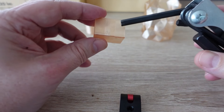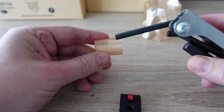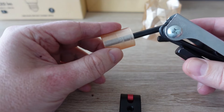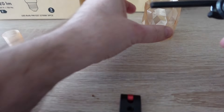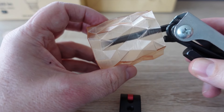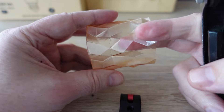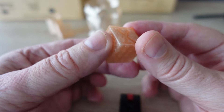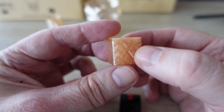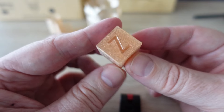Now let's see the wall: one, two, and three wall thick. This is just a cylinder with two walls and three wall thick — transparent but not so nice. Checking vase mode printing: the allen key is in the middle of this object, and now next to the wall — this is really transparent, and here you can see it with my finger. This is a calibration cube with three bottom and top layers and one side wall. On the side walls I can see the pattern of the infill, and on the bottom layer too, but it is not so visible on the top layer — interesting.